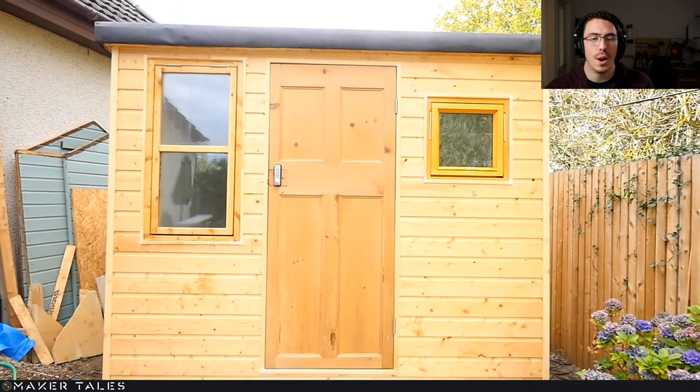I did have one other problem, which was right here on my DIY window. I realized that I had to angle this downwards like I have it for this one, because I did have water pooling in. So all I did was cut it downwards, and then I put some bitumen paint across there to make sure the water just ran out, so I didn't have to worry about any water running in. Apart from that, that's pretty much how the build looks right now.